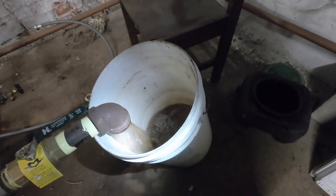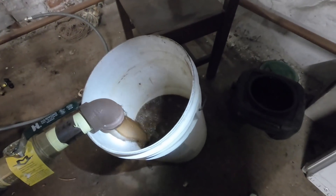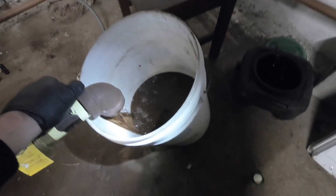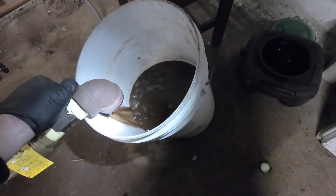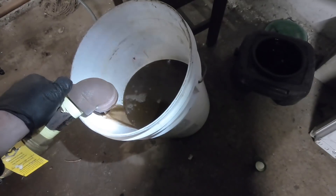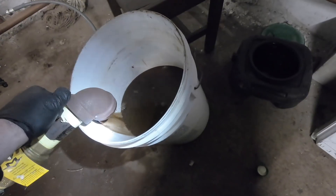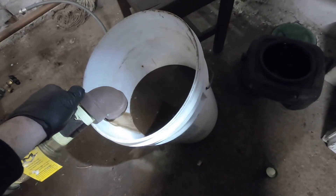Coming out pretty clear — so there's the boiler water now. The water coming out at first is just what was in the piping, but this is what's coming out of the boiler. I put some surge protection and boiler cleaner in, but they've never drained it. Still a lot of gunk in here — this is why I recommend draining it all the way, or else you never get this gunk off the bottom.